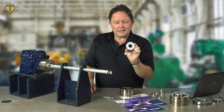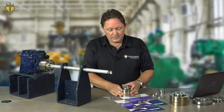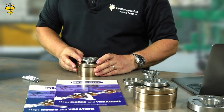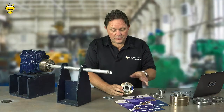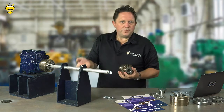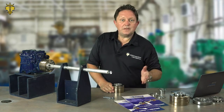The hardest part of the install is actually getting this to go over the propeller shaft. It's an interference fit, so it's a very tight fit and it can be really hard to get on sometimes. Once it's in, before you tighten everything up, the unit comes with little wafers — four of them — and you can lock it off so that the ball joint is true. Once you've done that, when you align it, you can back off the bolts at the back, pull the Sigma Drive off, and put feeler gauges in to align it. Although it is very flexible, we've designed in a way to align it even if you wanted to. The nice thing is you don't have to rely on critical alignment anymore — you can eyeball it with a rule or a piece of tape, and the Sigma Drive will be fine.